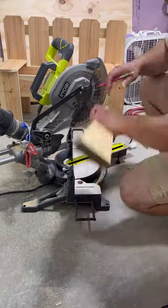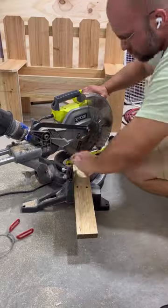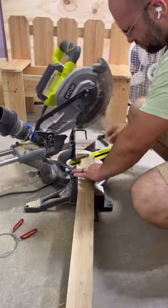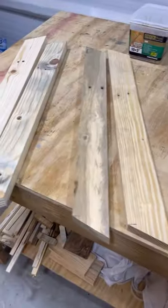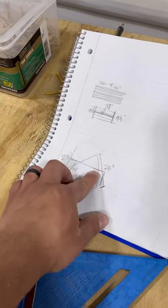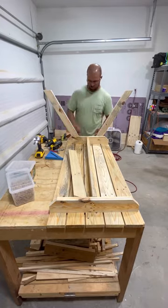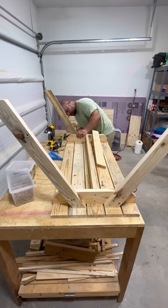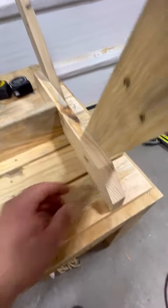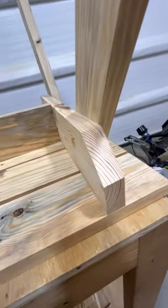Here we're cutting some pieces for the legs — both ends get a 30-degree cut. Make sure they're all the same. We're building a picnic table, not a rocking table, so measure twice, cut once. Got a couple pokies — nothing a grinder can't fix. Let's make them disappear.